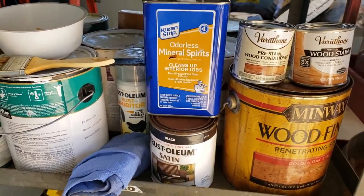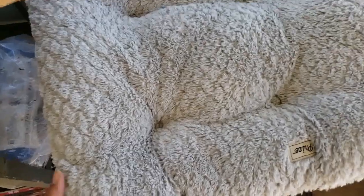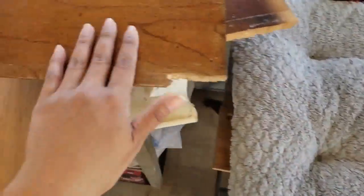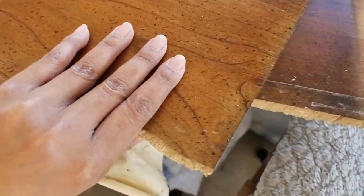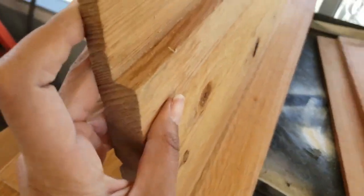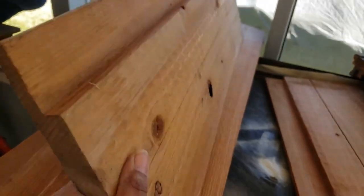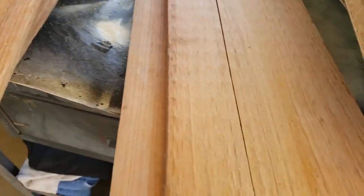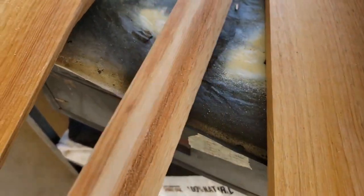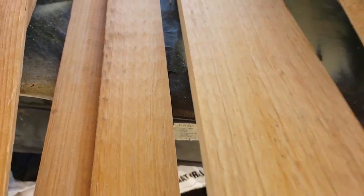And rags, as well as stains and paint. The cushion of the bed will sit on the base, which will be made out of the old particle wood. That base will sit into the half-lap joinery that the shiplap scrap wood already has. What I need to do is get it cut down to the size that I want, and then I'll save the remaining piece for another DIY.